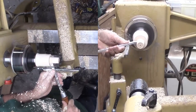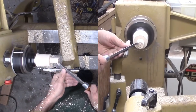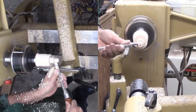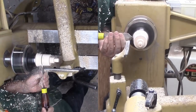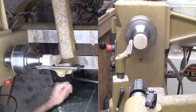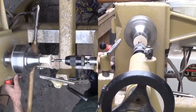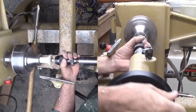I've first rounded the wood, cut a tenon and mounted it into my chuck. Now I want to shape the tenon which will also be the neck. Once the tenon fits, I'm tapering the neck out. Once it fits, I'm reducing a portion of the wood to a smaller tenon that I will cut out later, then part off what I need. Now it's mounted to the long nose jaws for drilling down to just above the chuck jaws, final shaping and sanding. For a base, I'm using a bit of bark edge from the hazelnut branch with the top and bottom and cut ends sanded.